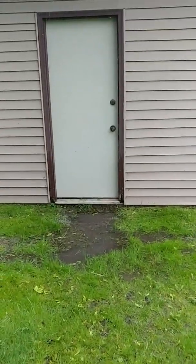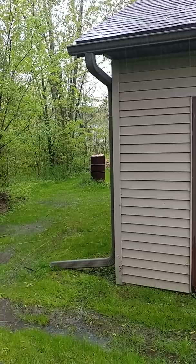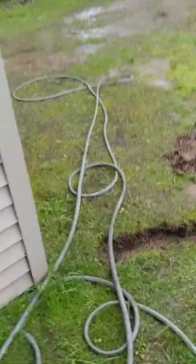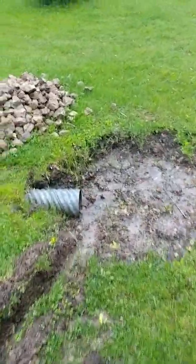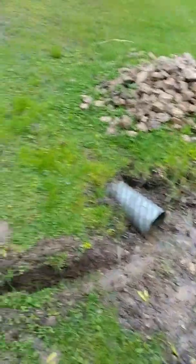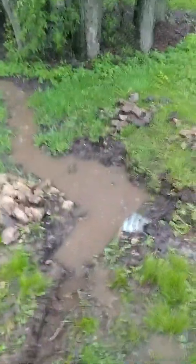I've got gutter issues — I already know what the problem is there. I'm going to re-slope both gutters so both downspouts come out the front. The gutters are going to go into these trenches here, come down to my culvert pits. I'll pull all the rock out, dig them out a bit, put fabric in, and put the rock back. The culvert goes over to here — it's super wet, I've got to build a driveway here too. The other downspout is going to be transferred from down there to here and come down this way.